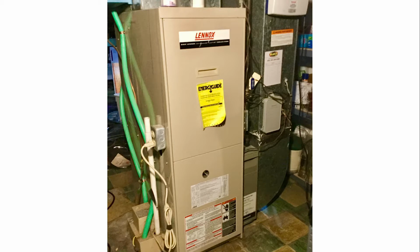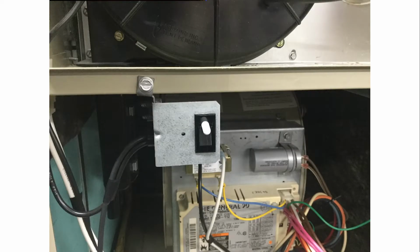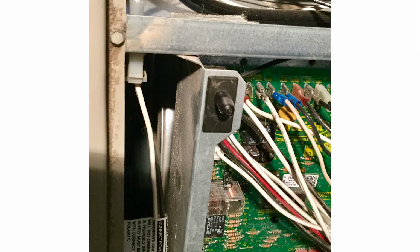A third place to check and see if power is getting to your system is the access panel. To allow for the interior of your system to be easily serviced, there is an access panel. Service can include simply replacing the filter or more complex work your dealer might perform. When this panel is removed, there is what's called a safety interlock switch that opens and cuts power to the system. If the safety interlock switch is not properly depressed when the access panel is reinstalled, your system will remain off. This will happen even if your battery-powered thermostat is calling for your system to run.